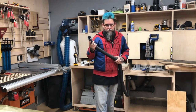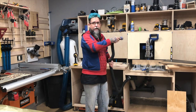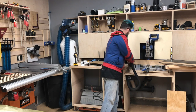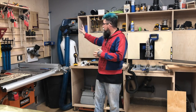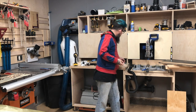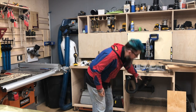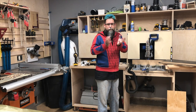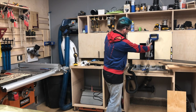It will come out to this table, and I prefer to move the table a little bit closer. The suction is less than connecting directly to the blower, but it's enough — it picks things up. It's not going to pick up big chunks of wood, but it works quite well. Then I have that Y directly coupled to another Y, and then it goes up into a duct vent type plastic piece — you can pick up for about nine bucks — about eight inches wide and three inches deep, across the back of the saw.